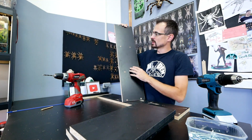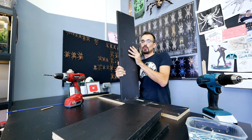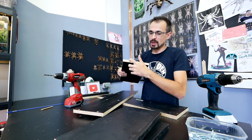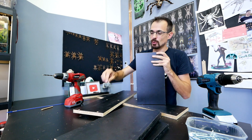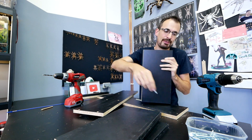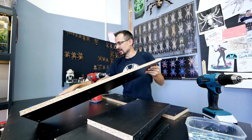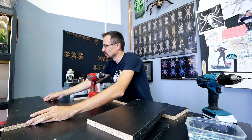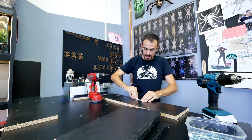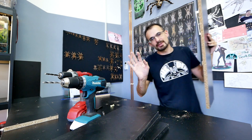I drilled the holes — one, two, three, four — all the holes needed for the shelves. To connect them I also need to drill holes on the joining piece, because if you don't, the screw will split the wood. You need to make holes that are a bit smaller than the screws. It's good when you have someone to help, but I managed to build the majority of these shelves alone, so this small one shouldn't be a problem. The only tricky part is getting the first two screws in — after that it's a piece of cake.